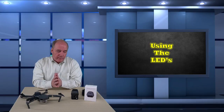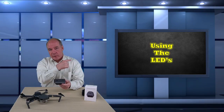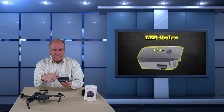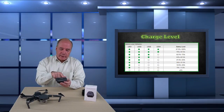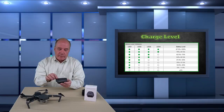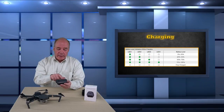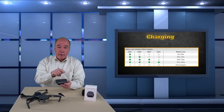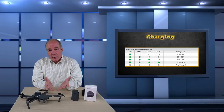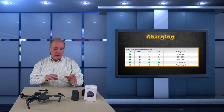How do you keep track of battery health? The LEDs across the top tell you a lot. One press shows charge level: 25%, 50%, 75%, 100%. During charging, you can watch them cycle up — the next LED blinks as you move to the next 25 percentile. That's helpful when you're in a hurry: do I need a full charge or can I go with 80%? There's also a failure indicator — an error condition that needs to be corrected — typically in one of three categories: a charging failure (overcharged or undercharged), a current failure (excessive inrush or short circuit), or a temperature failure (charged too cold or too warm).